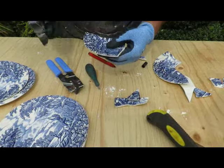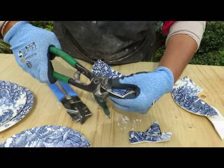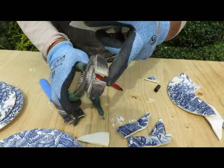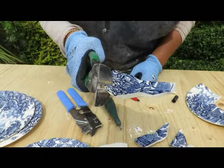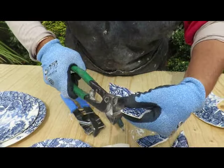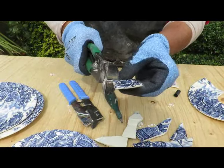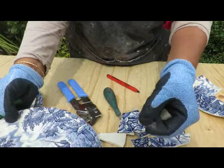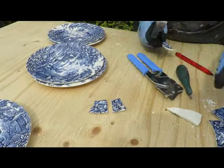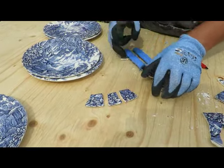The other way of doing it is using the side biter that I've used before, and you can find that on my other YouTube films on how to cut. But this would be an easier way of cutting. So you've got the curved end facing it, and you're just using a little bit under half of the tile nipper just to cut it. That way we're not smashing up tiles — we're nipping them. And then what we're doing is shaping them like so, so that we've got a nice same depth of line to make a pretty pattern.